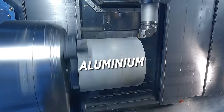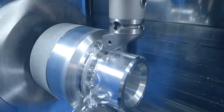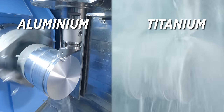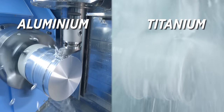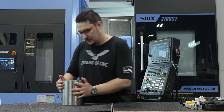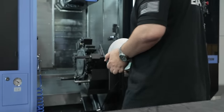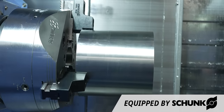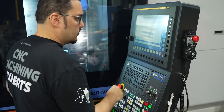So I asked our film crew if they could also film the aluminum setup piece that I'm going to be running to prove out my program and make sure everything's dialed in on the new machine. That way you can have some footage of the part running dry. For the setup piece, I basically run it at the same depth of cuts and the same program — I just crank up the speeds and feeds about 40-50% using the override controls.